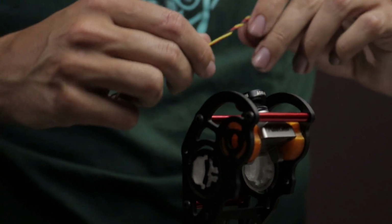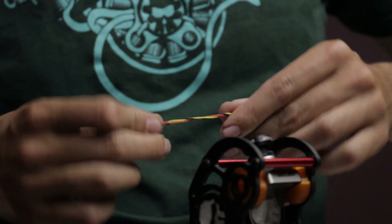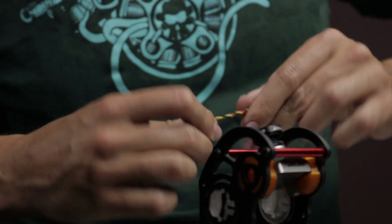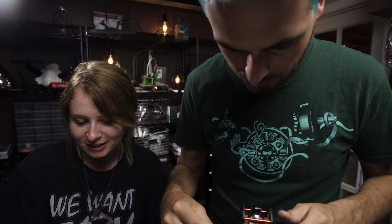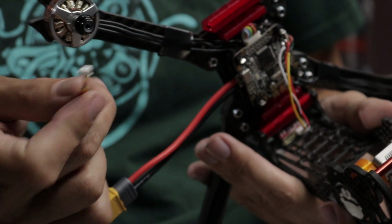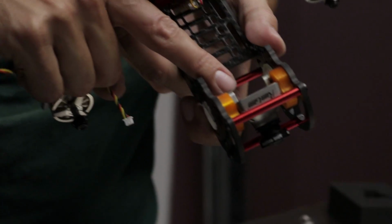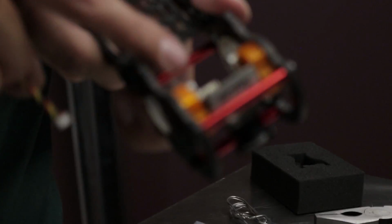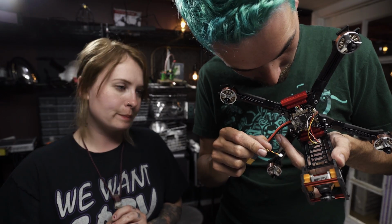And this one's going to run a little bit longer, I think, because the way we have this, the hood of this car quad thing opening up, we're raising the camera up. The bonnet. This simple connector that just has power, ground, and video is a lot narrower than the total connector that has power, ground, video, audio, battery voltage, all that stuff. So just make sure that you line up the red wire with power.